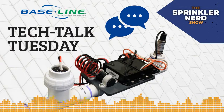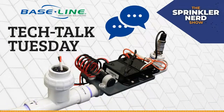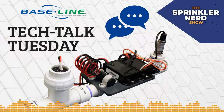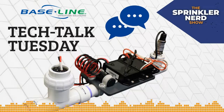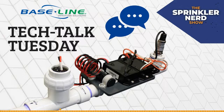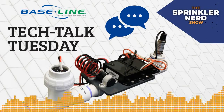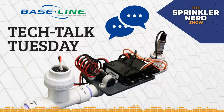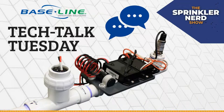We also know that a 10 PSI change is going to give us up to a 40% increase in water use or consumption. So if we can better manage our system pressure, we can better manage our water resources. Pressure is another data point we can use to make better management decisions on our irrigation — and it's very helpful for diagnostics too.